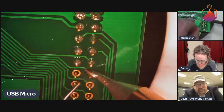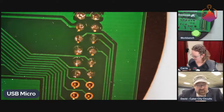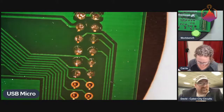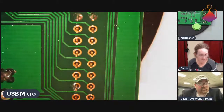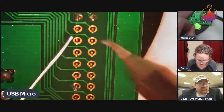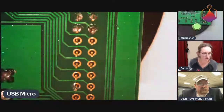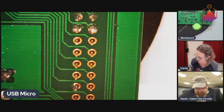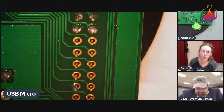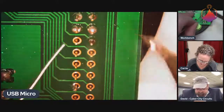There's a lot that people don't know about electronics and regulations when they haven't done that before. When they're just like, oh, I have this idea about this electronic thing that I want to make and I want to hire some people to make it. A lot of people are very surprised at how much money it costs just to add something like Bluetooth to a device. Legally, you have to have your device certified by the FCC. Even if you're using a certified Bluetooth module in it, you still have to have your entire thing undergo testing and make sure that you're not emitting and stuff like that.